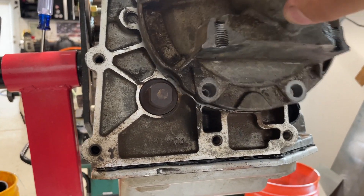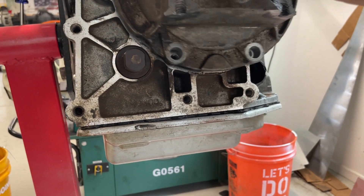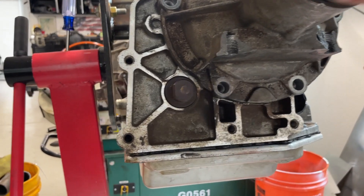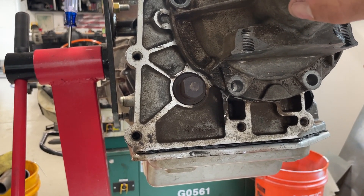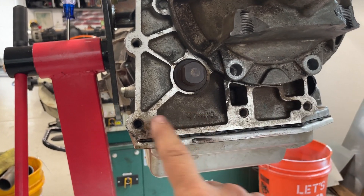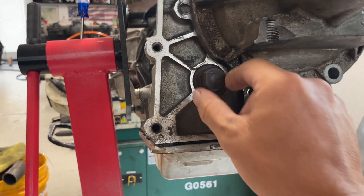You can see this tail housing just really isn't that thick of a piece. The inside is just a cast piece of aluminum - it's good for probably taking all the loads you'd have in a truck with nice suspension on a main road, but when we're beating it around, especially when we had a shock failure, it just wasn't strong enough. What I'm going to try to do is engage these three holes right here - same bolt size - so I'm going to make a plate that goes across here and bends over.